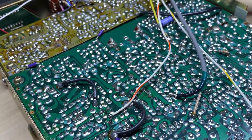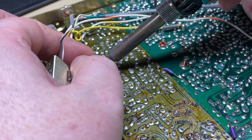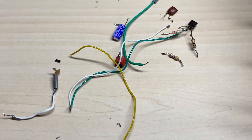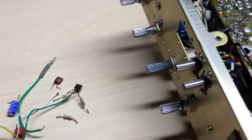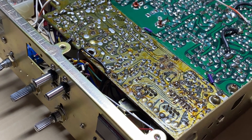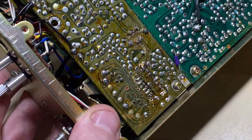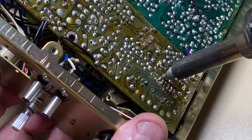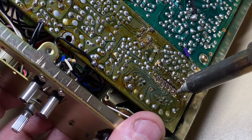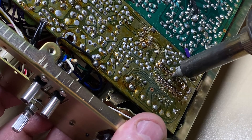I'm sure it would have made a bit of a difference, because we all know these whole 5-9s were a little bit muffly on FM due to the way it modulated the crystal and not the VCO. There's our pile of parts. Two switches coming out - seeing these switches have been used for something else, we're going to repurpose them anyway. So let's get the PLL out, because we're going to be replacing that.